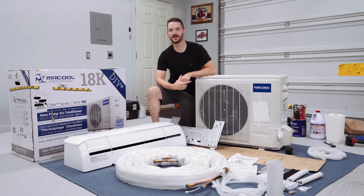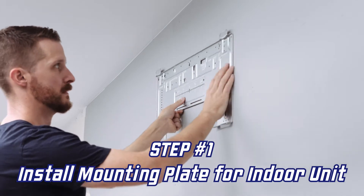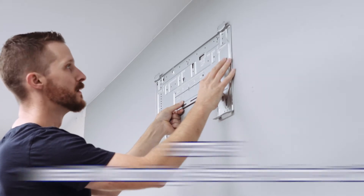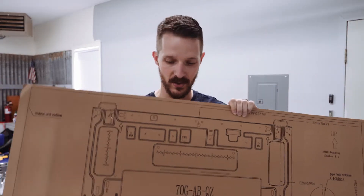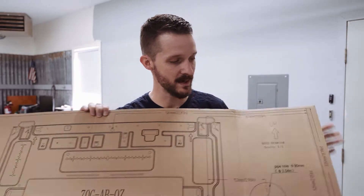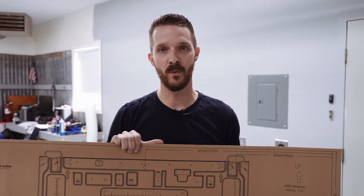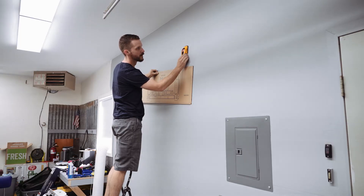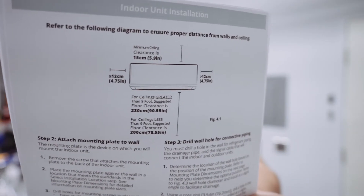It's a lot of parts, a lot of opportunities to screw up, but we're not going to screw up because we know what we're doing, or at least we have instructions. First step in installation is you're going to want to install your mounting plate for the indoor portion of your heat pump. Your kit comes with this very, very handy, easy to understand wall template. It has mounting points so you can kind of line up your studs in the wall, and then also a perfectly spaced place where you're going to be using your three and a half inch hole saw to drill your hole for the lines. You're going to want a stud finder to make sure you know where your studs are in the wall. Try not to drop your stud finder. Read your instructions because they come with a lot of helpful information.